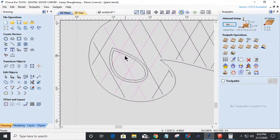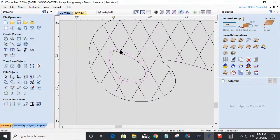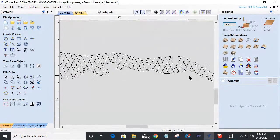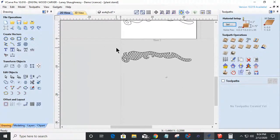So with those selected, if I select that outside boundary last, I could trim it again, clearing outside of that, or inside this time, clear inside of that boundary away. It'll get rid of that, and then I can get rid of that offset. And that just gives me that little clearing all the way around. And I can use this pattern to either do a V-carve crosshatch type pattern,